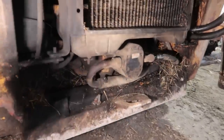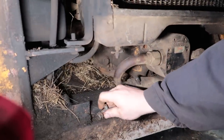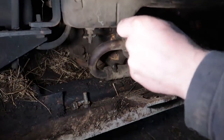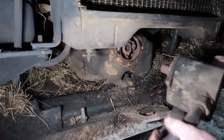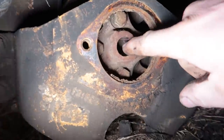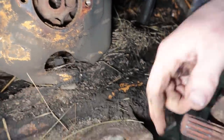The hydraulic pump is quite easy to get to — it's bolted right out the back. Take these two bolts out, which are a bit of a pain because the socket can barely fit on them. Pry it off, get it out, and here is the issue: these couplers wear out. It's round and round — doesn't turn this anymore.